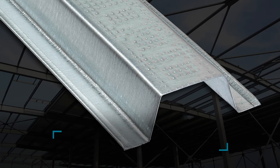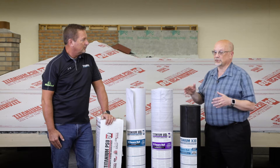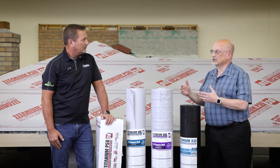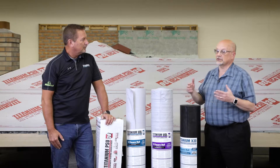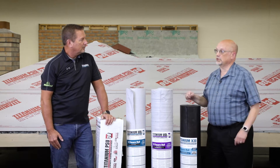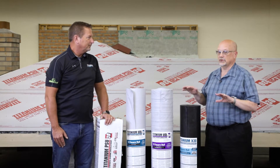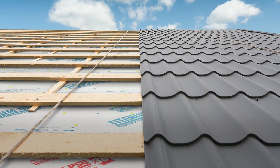Those have been manufactured and designed for that purpose. There is also a hybrid system out there. There's a product genre called stone-coated steel, and those products are used a lot residentially, on multi-family, and some religious facilities. Some of those systems are actually what we call batten-mounted, so you actually have to have horizontal battens, and the panels fit over those and get fastened into place with exposed fasteners. A lot of times those battens are actually on top of a solid deck.